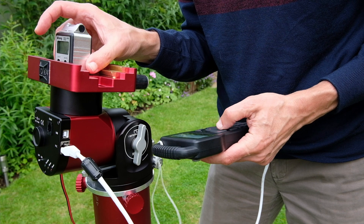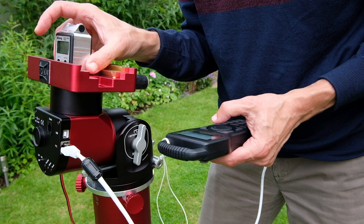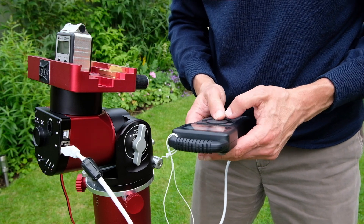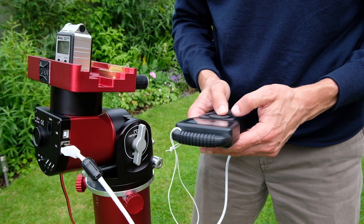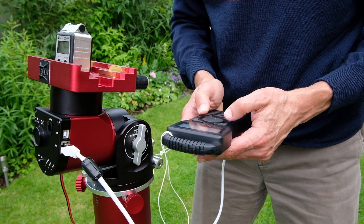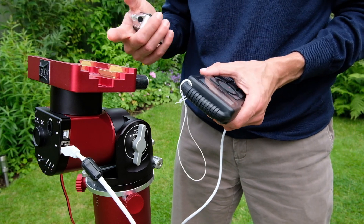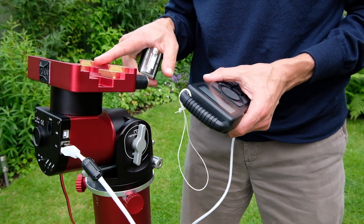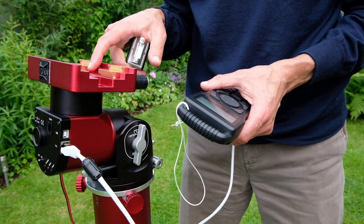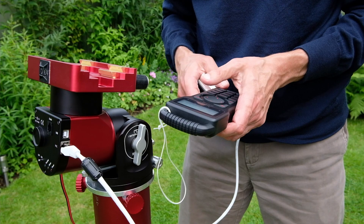So slow it down — that's in the middle now. Again I go into long ENT, mount setup, offset set, press ENT, and it's put in the new coordinates. So there we have it — that's the way I set up the mount so that it's accurate. A couple of users found we had exactly the same numbers in the system, which means it was just a factory default, but tuning in like this just improves the accuracy slightly. Thanks for watching.